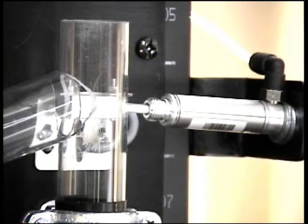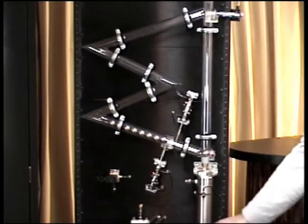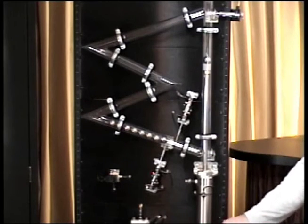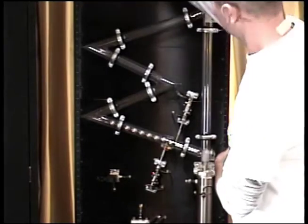We're just moving balls around, but what this allows us is to actually use both double acting cylinders, single acting cylinders, poppet valves, spool valves, the large cylinders being controlled by a 5-port, 3-position blocked center solenoid. And actually, Shane, if you want to throw it back over into manual,